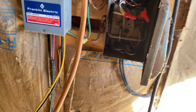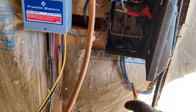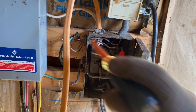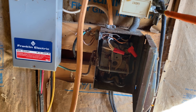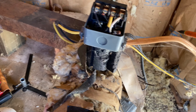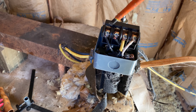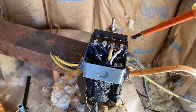So let's trace the system and see if we can find what the problem is. These two wires here are coming from the house - this is 240, 120 and a 120 - coming up to this disconnect box. It looks like it's grounded here, so that's why there's only two wires. Now these two wires that come out of here, this is 240, going into the controller. I tested those - we got 120 there and we've got 120 there. That's connected to the switch, so that's feeding the switch.